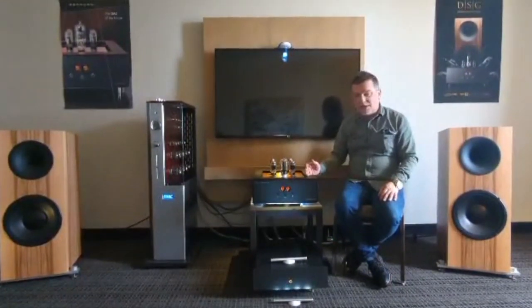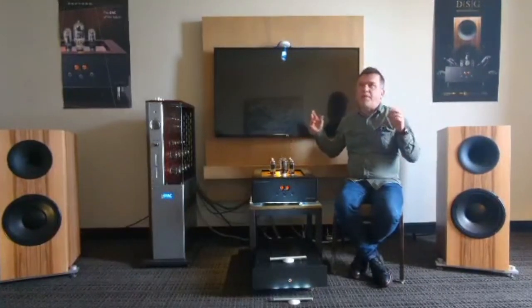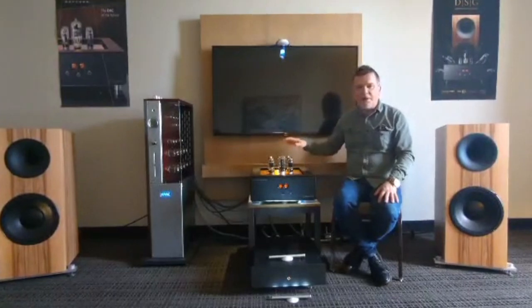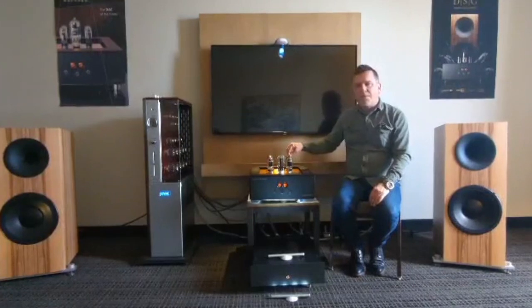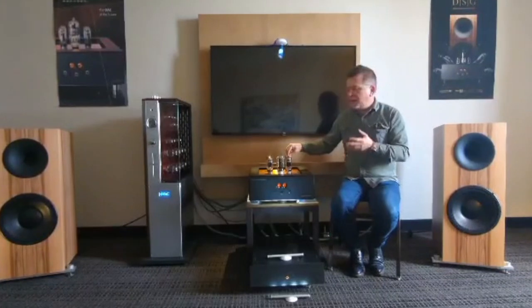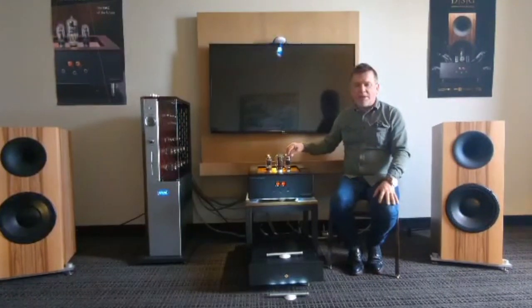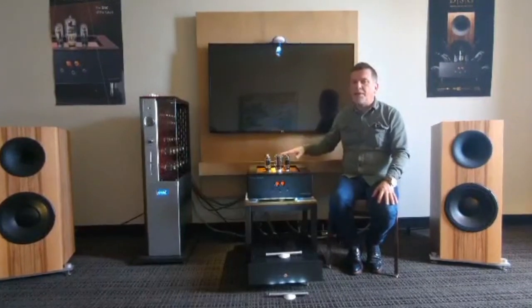And my last comment is that the power tubes, you should ignore the popular misconceptions or tags attached to certain brands or types, because anything you've ever heard or anything you've ever written about these power pentodes, it was said in the context of the power amps, and this is not an amp, and the application is completely different. It has a different operating point, different voltage, different application. So any comments about KT88 will come from the amplifier world and are not applicable here.